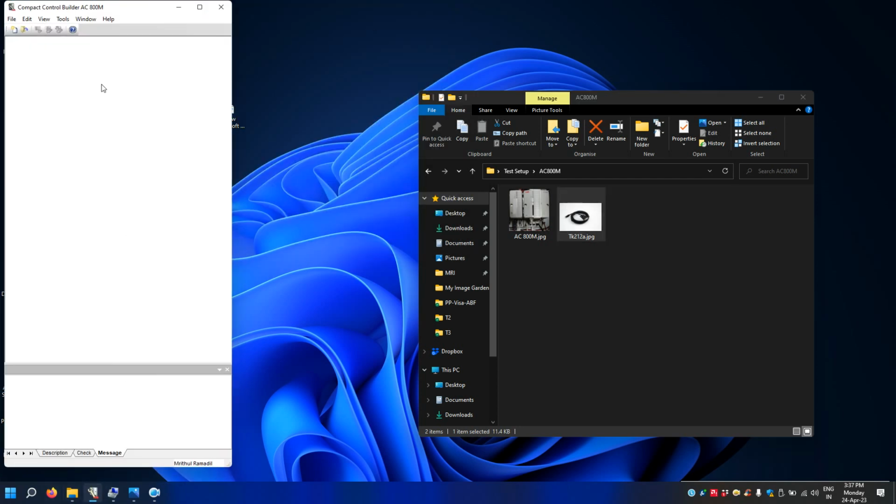Now open the software, we'll create a new project, AC800M. So we can give some name. Okay, test setup. Okay, so this is the basic program that opens by default. So first thing, go to the controllers. So let's add our PLC.